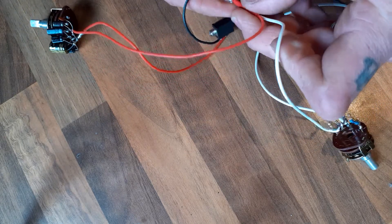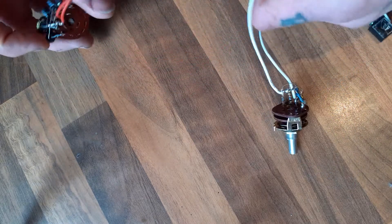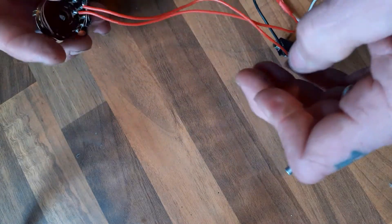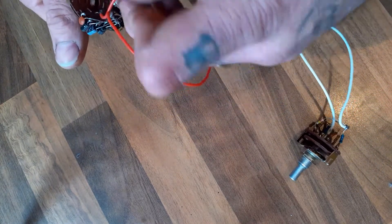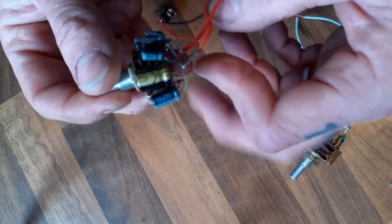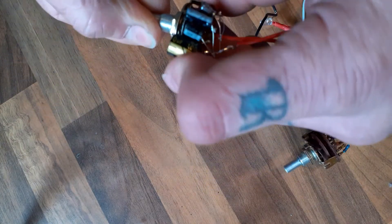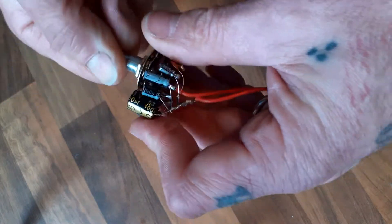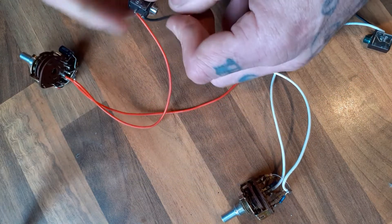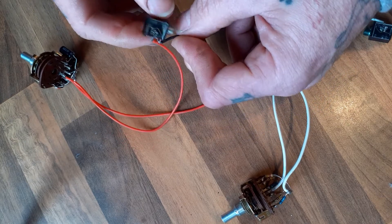the other side of the LED — the long leg — and that in turn goes out to another multi-pole switch. That center feed has a different array of capacitors that we can select between to change the desired effect, and that comes down to the output jack.